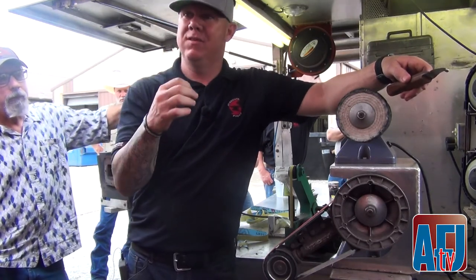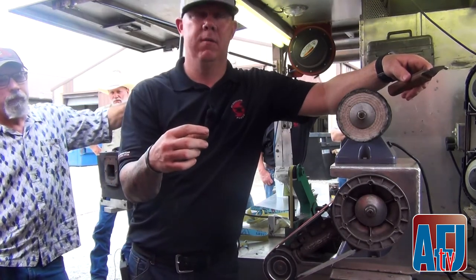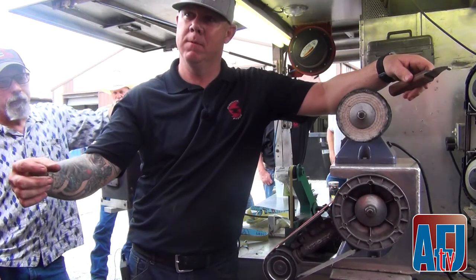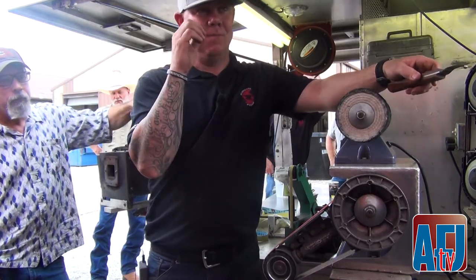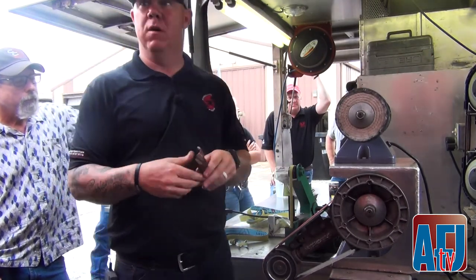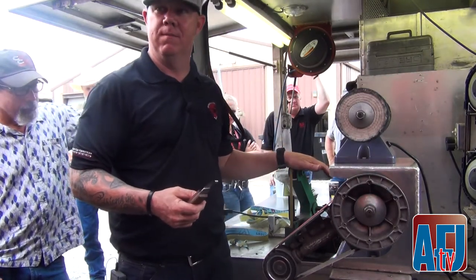There's actually less pieces of sand per square inch on a 40 grit belt than on one that's 220. And there's less on a piece of 220 than there is on a piece of 320. So the finer the belt, the more pieces of grit are actually on there, and they get hotter a lot faster. So the finer you get going, the hotter these things get quick, especially when you don't have anything to turn the machine down.